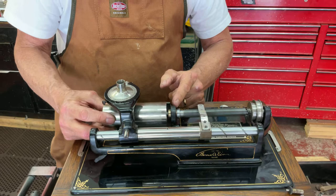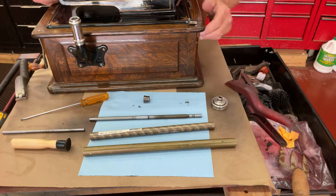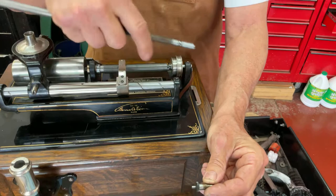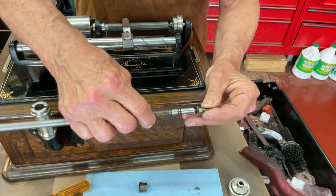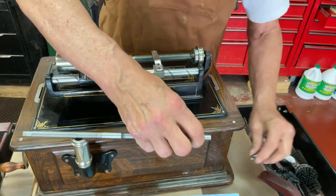You'll see this little gap — I have about five thousandths of an inch of play. You want to check the mandrel shaft, that it spins freely, and make sure that the end bearing back in the casting — this gear helps drive it — that you put this in. This one is worn out in here, there's a little bit of play. There shouldn't be a lot of play — you can have a little bit — but this is really shot. These are things you need to look at when adjusting these.